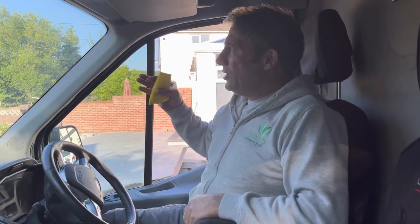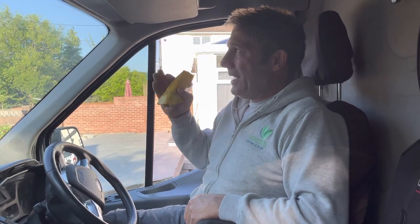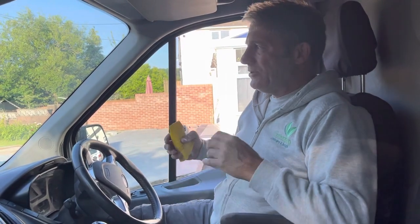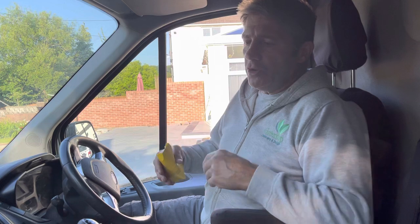It's a beautiful sunny day today, so you've got to make sure when you're working in inclement weather conditions — and in some respects this is inclement — it can be detrimental to the sand and cement you're using. If you're using a dry mix, it can dry up quite quickly because when the cement is exposed to sun it starts to go off. Same with a semi-dry mix. Try not to mix up too much — always try to work with what you can actually manage.